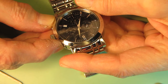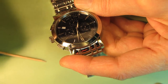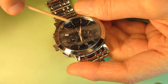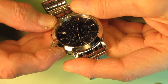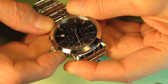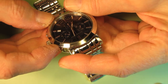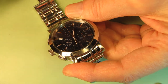Now it's ready to set up to the zero position. I push this button and stop pushing when the hand is exactly on that position. Now I push the lower button, and this allows me to set this hand. It's already in the right place, but I'll do it for purposes of this video — going step by step until that hand is in the zero position again. Then I push this button again and set up this other hand step by step to the zero position also.